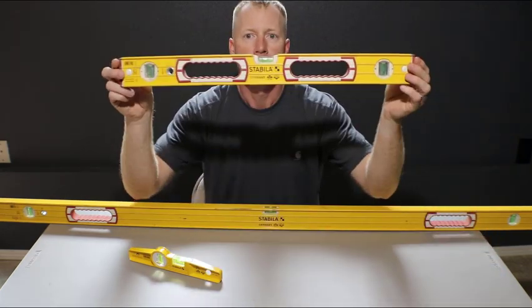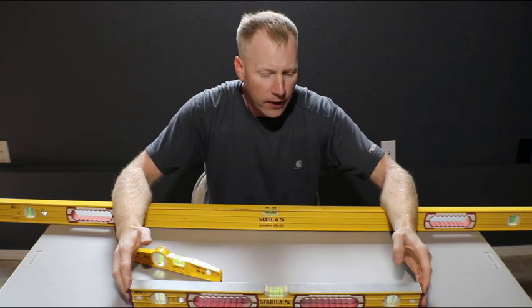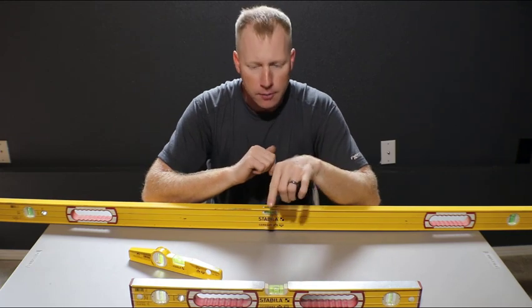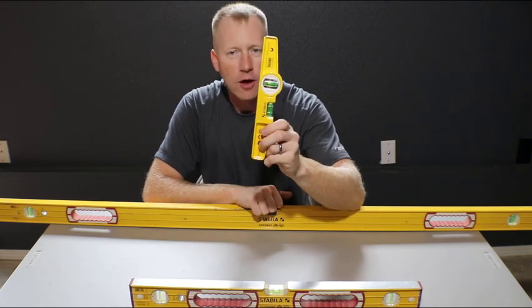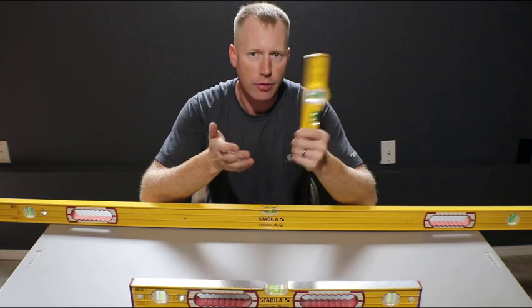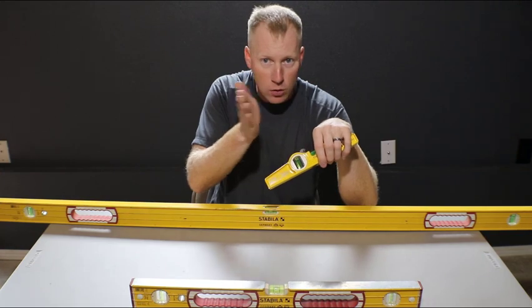This is a door-length level, so it's slightly shorter than a typical door jamb but it's very expensive. You can get a shorter level which is less expensive, but it's not as accurate because you're not plumbing up against quite as long a section of door or wall. If you have a stud with variations you're going to be inaccurately plumbing against a bow in the wood. Ideally with a wall you're going to plumb from the sill plate all the way up to the top plate. Sometimes carpenters just use a short torpedo level, which gets you fairly close but not really precise — you might be a quarter inch or three-eighths of an inch out. The idea is to get as long a measurement as possible for the most accurate setting.